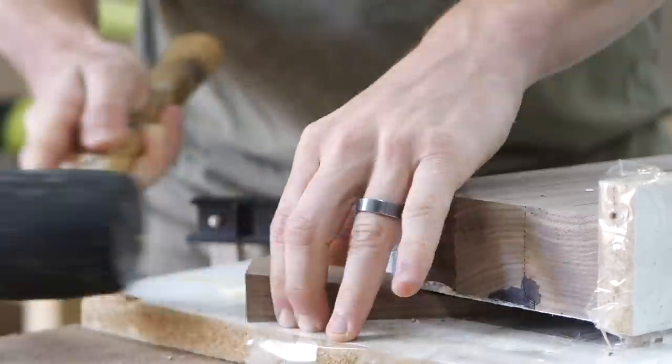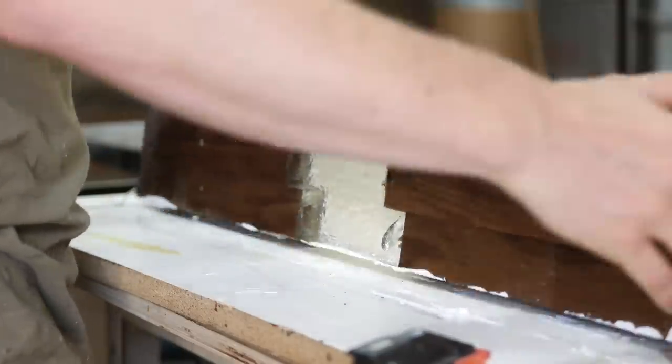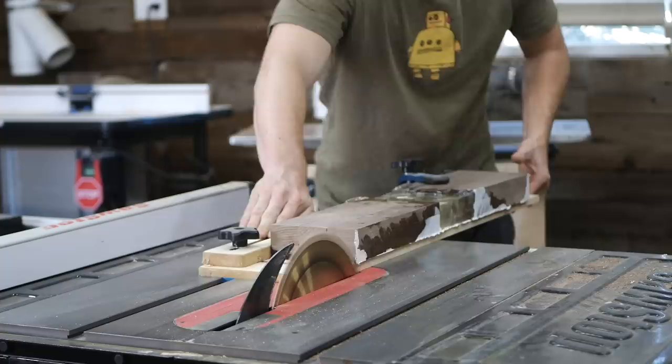Demolding overall was easy, removing the screws, knocking out the walls. The easiest way to pop it off the base is to use a wedge and slowly hammer it into it until it pops right off of the mold.